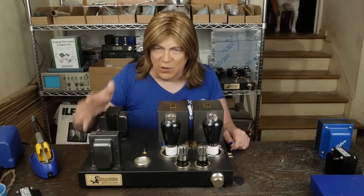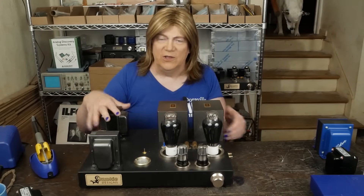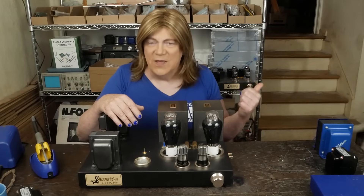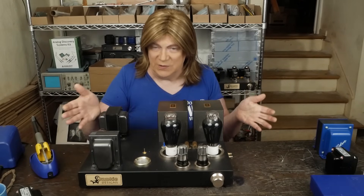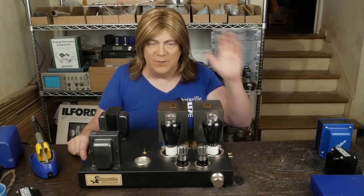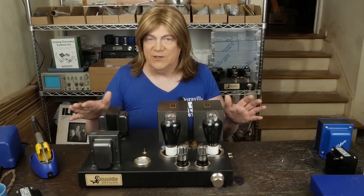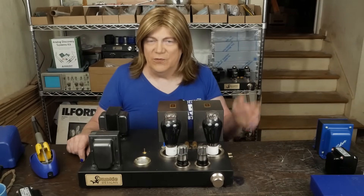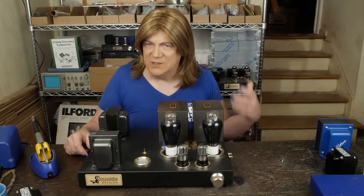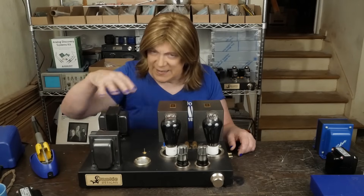Another thing I've told folks: don't try to use a colorful tube preamp with a colorful power amplifier — do one or the other. A 300B or my EL34 amp already has enough harmonic distortion naturally that it doesn't need that. Someone wanted to buy my phono stage, color preamp, and EL34 all together, and I talked him out of it — that's too much of a good thing. Instead, I'm building him a KT88 integrated more like my KT120 monoblocks, with much lower harmonic distortion, that can actually use the color the preamp adds.